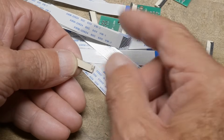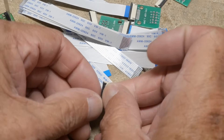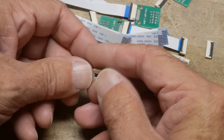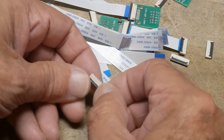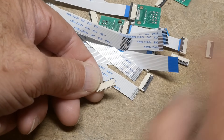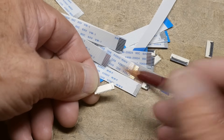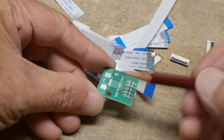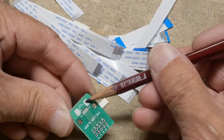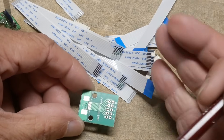There are some hidden features on these things — not just the latchy thing. This one here has a pull-out and push-in for the zero insertion force mechanism. Some of them toggle. When you put this down on the board you figure you're going to rip it right off, but they have these tabs at the end — right here and here — that don't make any electrical connections, just mechanical ones. So when you lay out a PCB you have to put in this big area so that when you solder the part down, it becomes the mechanical structure holding the connector down. All the other pads are electrical, but you must have that mechanical connection.